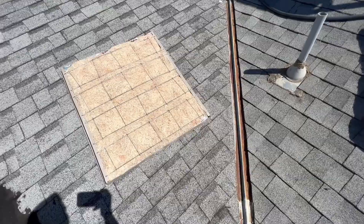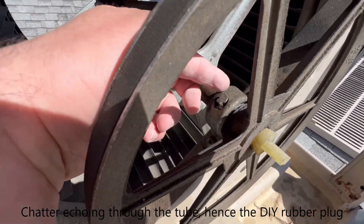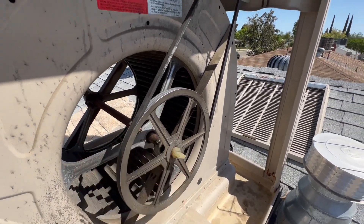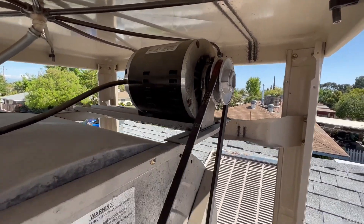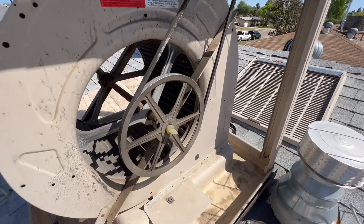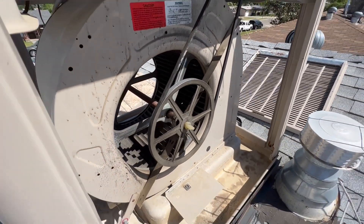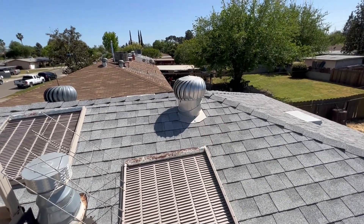Check the oil cups — flip this up and drop some oil in until it fills up. Check all the way around on this side, the other side, and up in here. There might even be a red plug near the motor to oil that as well. Depending on your brand of swamp cooler, check those things too. Also make sure your whirlybirds are moving.